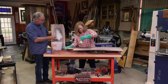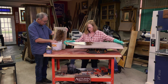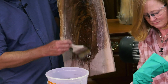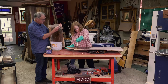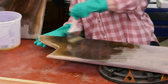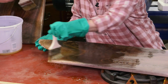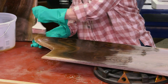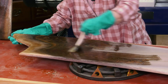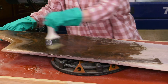While she was out there sanding, I made another smaller version right here. I'm bringing the grain up on this knot — that's what you want with your boards, a lot of character. We'll brush this out on both sides. Whenever you're working with things like this for food contact, you need to seal all the edges and the bottom as well, to preserve it. With salad bowl finish, you can rejuvenate it with a light sanding, clean it, and bring it back up. Once it's dry, we'll attach hardware.